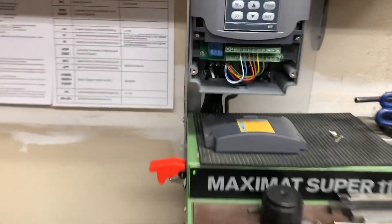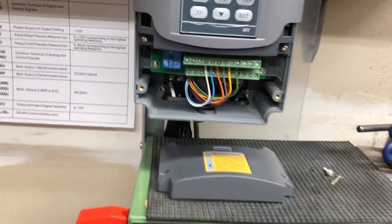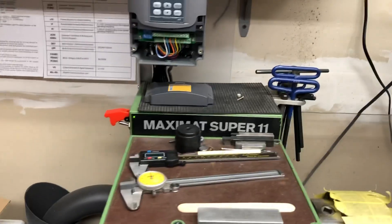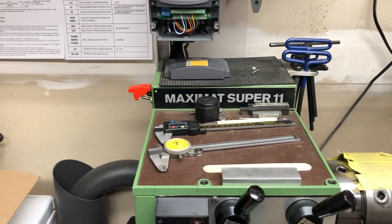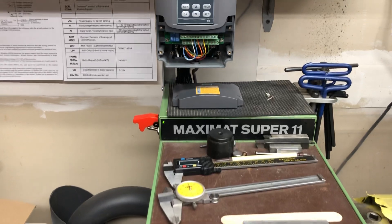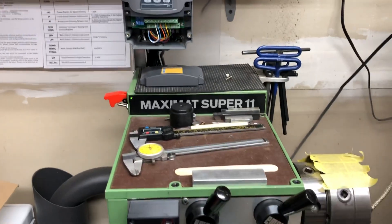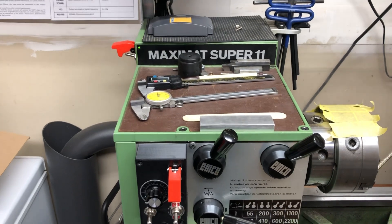The practical part of putting this together was pretty straightforward. The wiring wasn't that complicated. After a little digging and some cut and try, I figured out that just the low speed windings were used and the high speed ones are just capped off. The motor is happy — the amperage is low everywhere throughout the range. The fan almost never comes on the inverter, so it's not working hard. The motor doesn't heat up. It's all pretty happy.